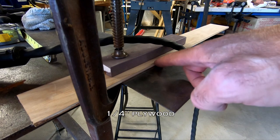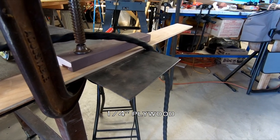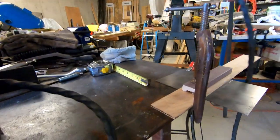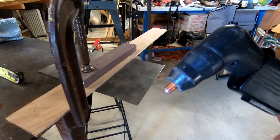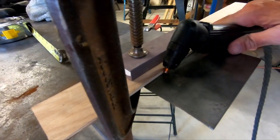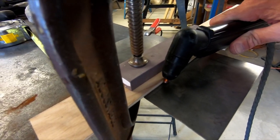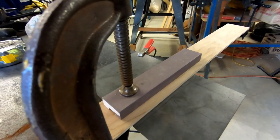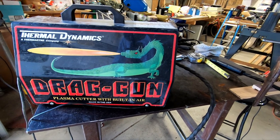I just have a straight piece of wood that will be my guide to cut this piece of metal off straight. The tip of the cutter can just run along that piece of wood. It's offset just an eighth of an inch so that I can cut exactly where I want to cut. So you can make a straight edge that's just an eighth of an inch away from your line on the outside, or an eighth of an inch to the inside for an inside cut.